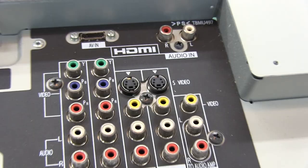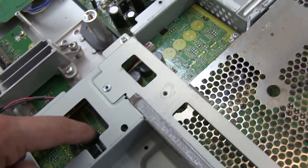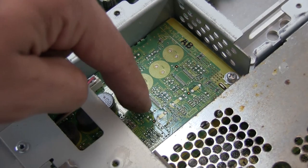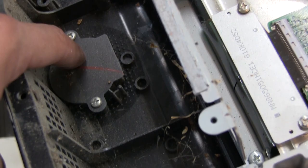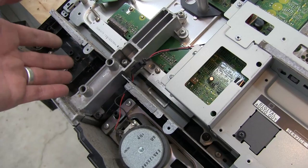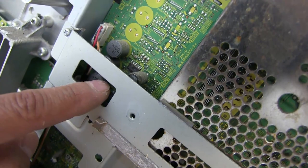All the other stuff here — HDMI. So that's probably the main processor board at the bottom, and this is the power supply for that. This looks like the amplifier for the speakers with wires going to them — so this would be like a class D amp. Judging by the missing components here, these would be like additional amplifiers, and that's probably why we have these covers with no components — it was meant to have them, or maybe they manufactured similar models where some had better audio capability. This board was designed for multiple amplifiers.